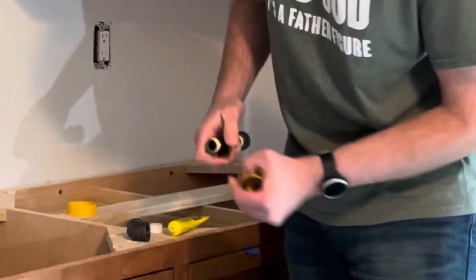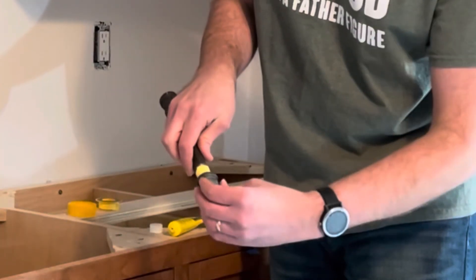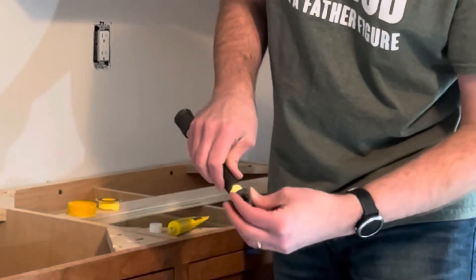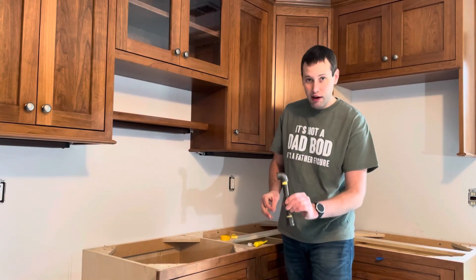There's three turns. When you're wrapping this you want to make sure you wrap it in a direction so that when you screw on your next fitting it doesn't unwind the tape — it tightens the tape down. I'm going to get that fitting on hand tight and now I'm ready to put this in.